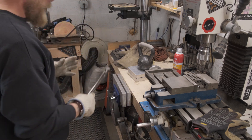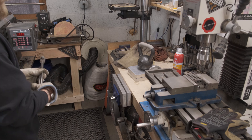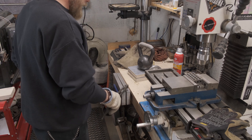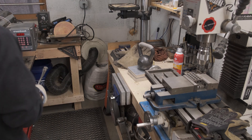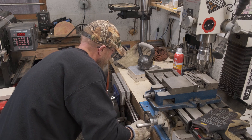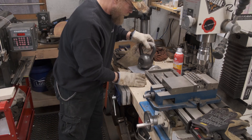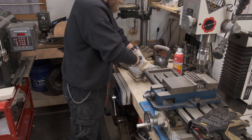The next one has a tapered tang, so clamping it can be interesting — you can get a warp in the tang if you're not careful because you're not getting full contact. These plates don't flex, so you're not getting full front-to-back contact with a tapered tang. You kind of have to work around how you clamp it — I tend to clamp it toward the end with the back of the tang hanging out. Grab it, close the kiln, drop it in, clamp it. Those first two are almost down to room temp already — good.